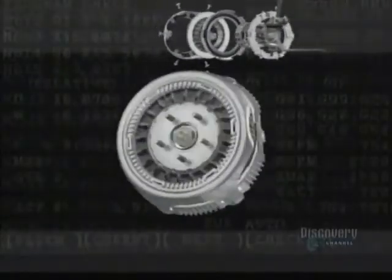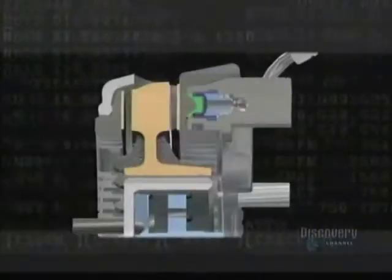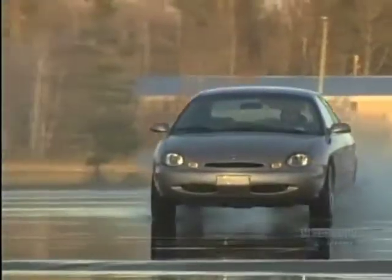The new floating disc brakes have two pads of friction material on 360 degrees of the disc circumference. When the brake is applied, hydraulic pressure activates the diaphragm, which applies pressure on the inboard pad, which is then pressed against the disc. In this animation, the diaphragm movement is exaggerated. However simple, the design of this brake calls for some complex development steps.